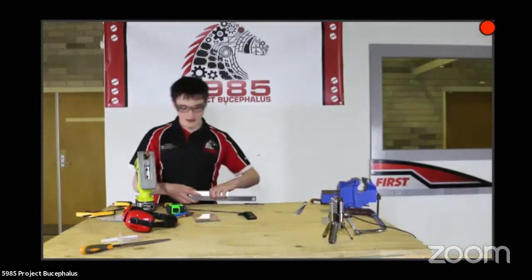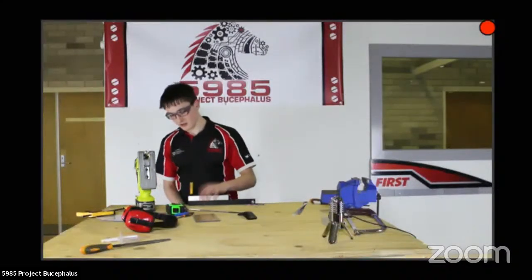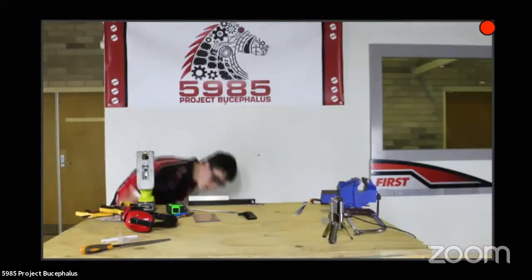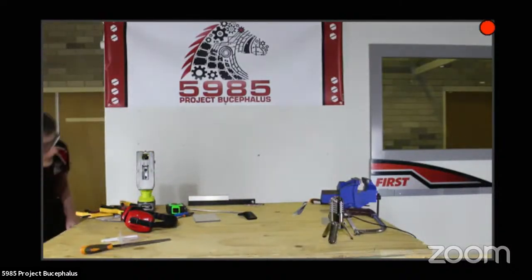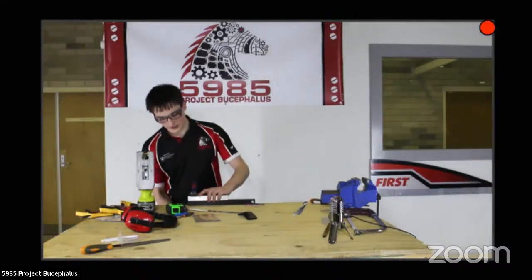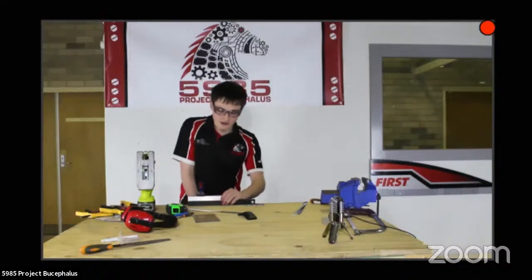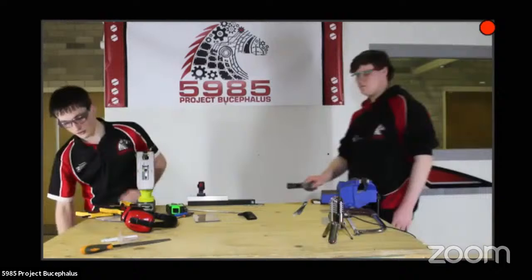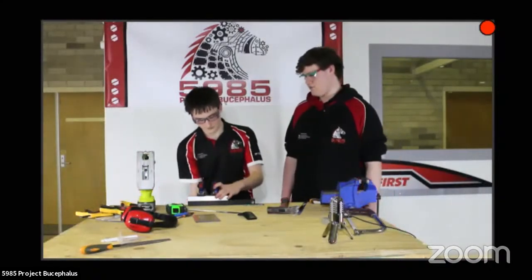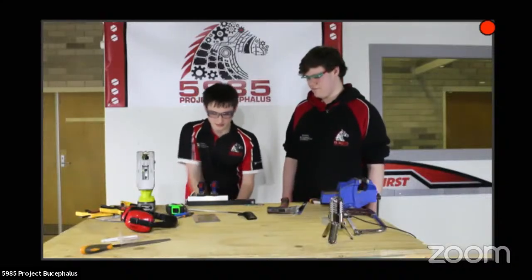is to get the two pieces of material and clamp one to the other. And I need a larger clamp to fit around there. If you clamp one piece of material to the other, you can then drill through both at the same time, thereby ensuring that the holes will be lined up. Bolt through, I guess. One bolt each side.